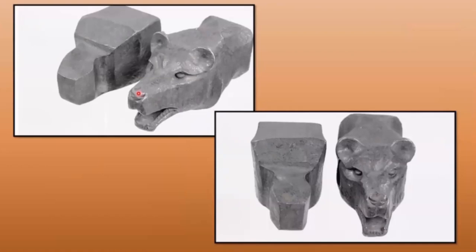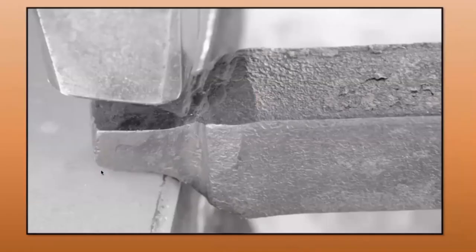And here it is. I've just fullered in. You can see I'm just a little wider maybe than the tip of the nose. And I'm going to start to dress this and then get rid of this excess material. You can do all of this without the tooling. You can mash it down on the edge of the anvil if you're fairly confident with your hammer blows.